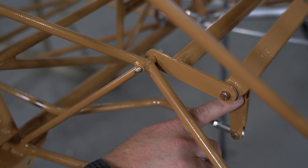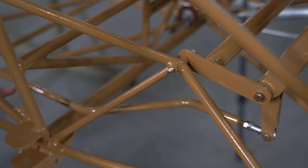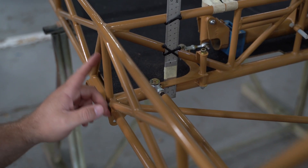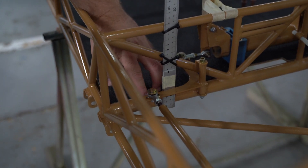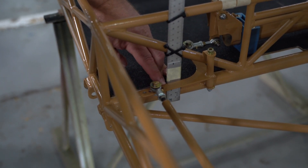With this pointing straight down as explained and the front bell crank locked, we are going to adjust this S-shaped push rod to fit exactly in the third hole from the outside, or the second hole from the inside.